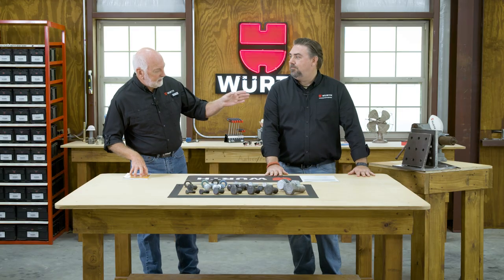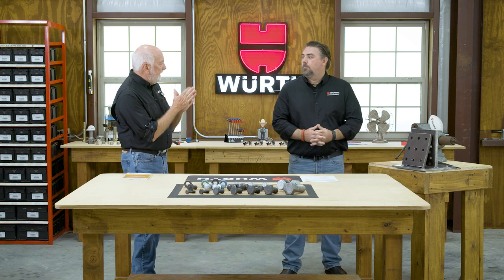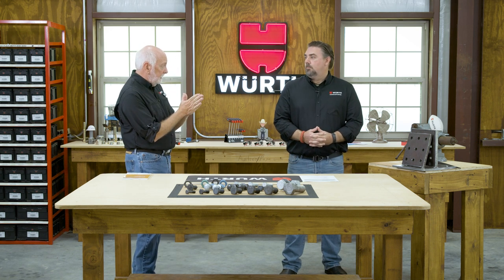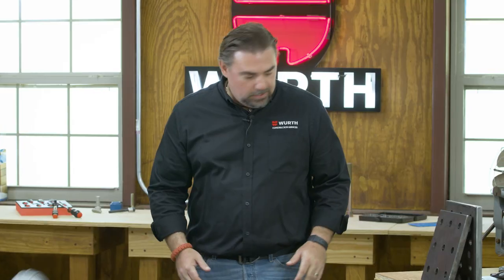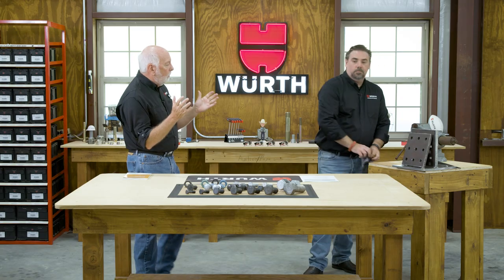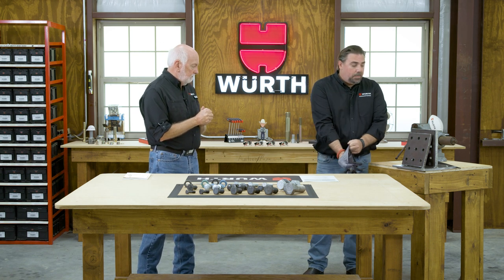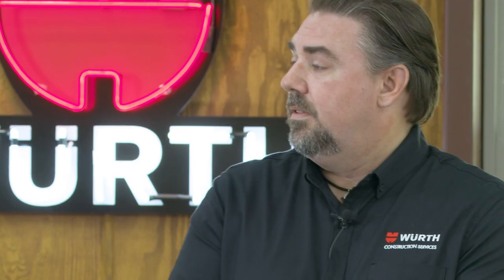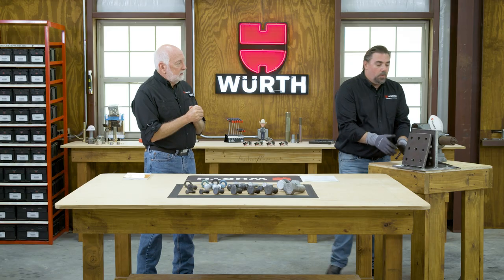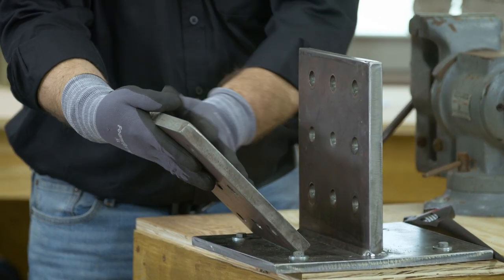Let's start with the steel itself. It comes plain steel, hot dip galvanized, and painted. For use with all of our structural connections, it's going to be a steel-to-steel connection — no gaskets, no wood, no plastics. When we reference faying surfaces, what we're talking about is really where these two pieces come together.